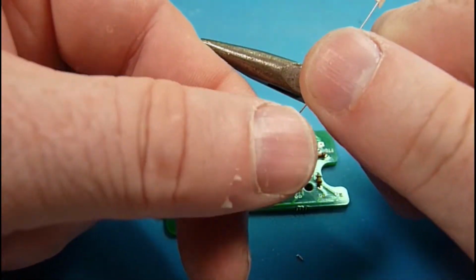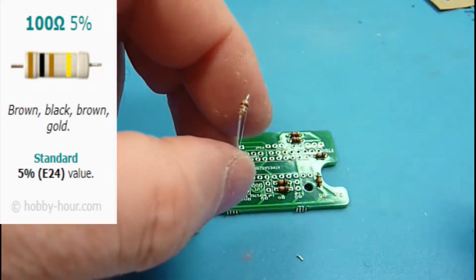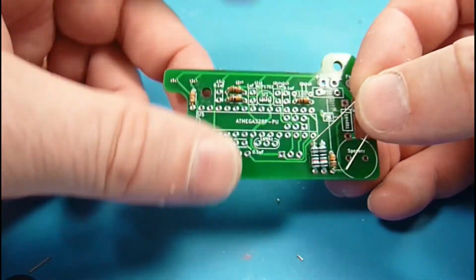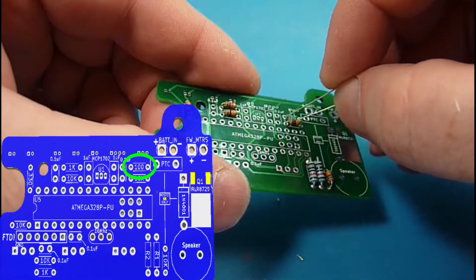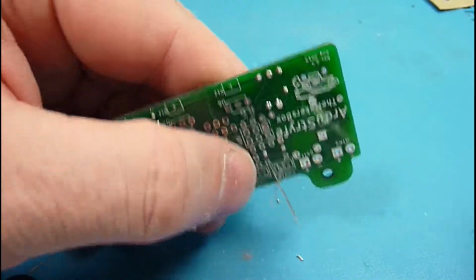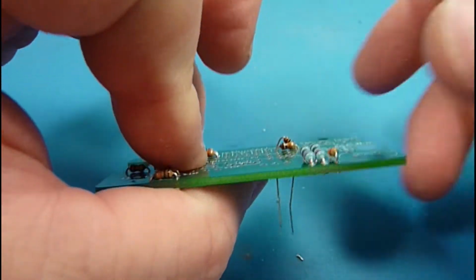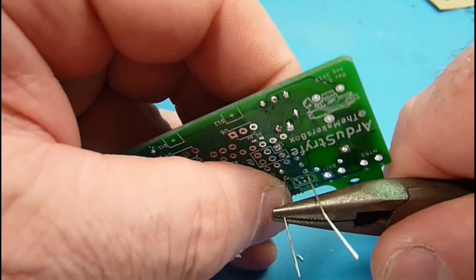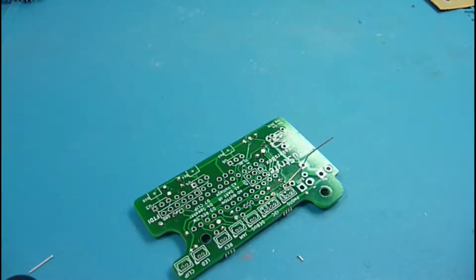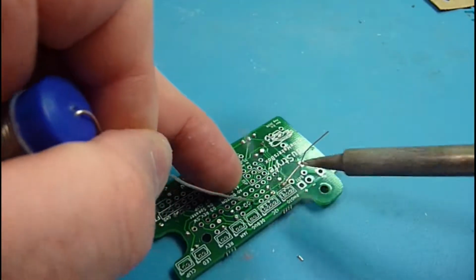Next down, and our final resistor here, 100 ohms, and this is also current limiting, but it is for the infrared LED. It has a lower forward voltage than a red LED, but also has more current at about 50 milliamps. So when you plug all those in, you end up with 100 ohms. And of course, this is what we're going to use to detect when our darts get fired. It'll be an infrared emitter detector pair, and this will be the light source to help us figure out when that dart flies by.